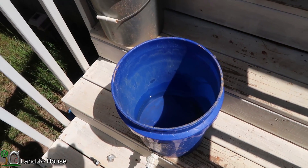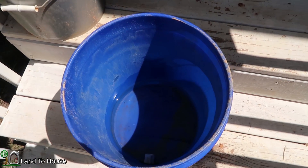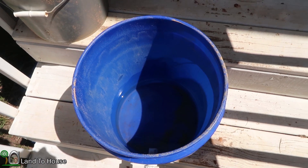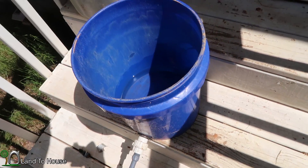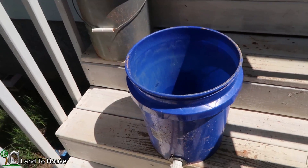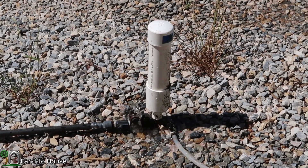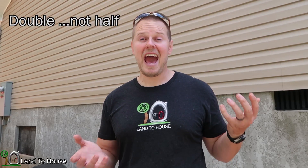Getting some pretty solid results. At 7 minutes on the dot, the water is quite far down — meaning with the delivery pipe open, it's going to require more water. The pump reached the end at exactly 8 minutes. Well, I guess that's what I get for assuming. The pump required 0.67 gallons per minute to operate with the delivery pipe open, which is almost double what it required with it closed. Definitely a good test to know about.